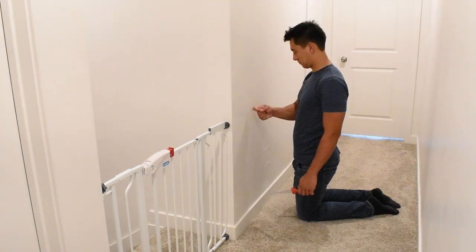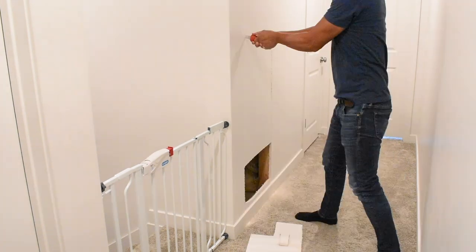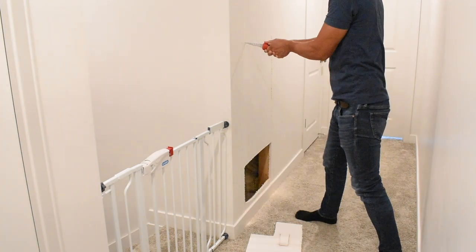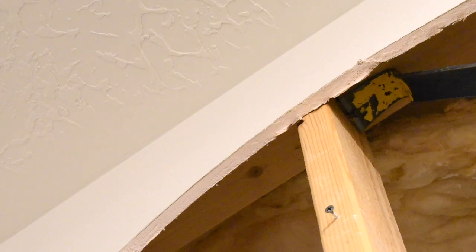Here's where I want to have the shelf. I found the most hollow-sounding point, cut a small hole, flipped on my light, poked my phone in — I wanted to see what was in there — and kept making bigger holes. As you're cutting, you want to make sure you're not going to cut any pipes, electrical, or air ducts. In this case I got lucky because of all this dead space, and I removed the middle stud.